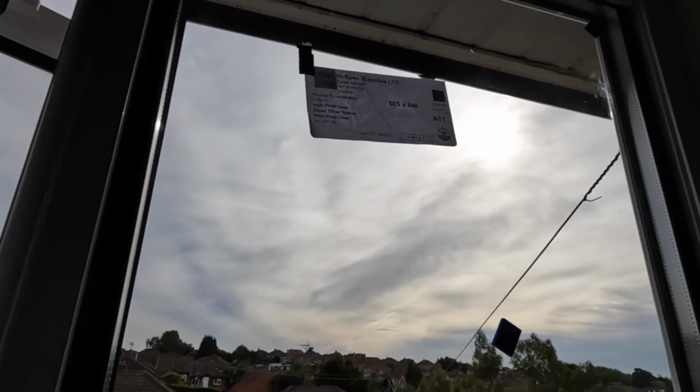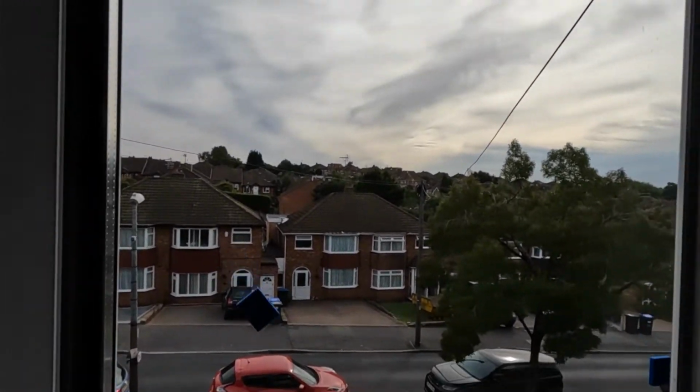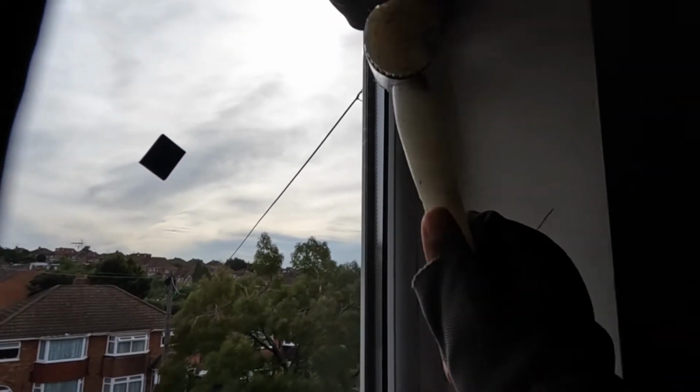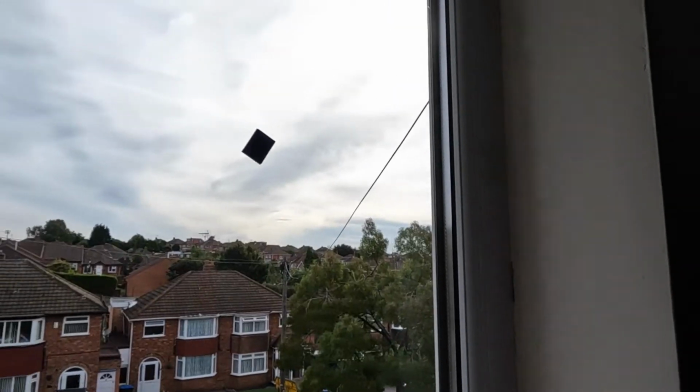You see it? That's why it's quite important to have a thin rubber mallet. Imagine using a hammer on that, you'll leave marks on it, and you can potentially break the glass, whereas rubber will absorb all the impact. When you're putting the long pieces in, can you see, you put the corners in first, top and bottom, and then you hit the middle, because you want to make sure it bends and fits in on each corner before you put the middle back in.